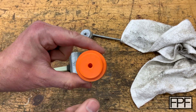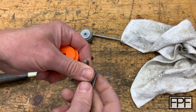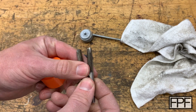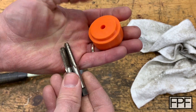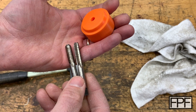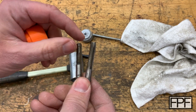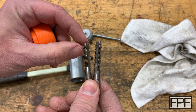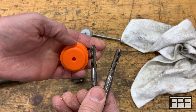I didn't make this hole super deep as I didn't want to get anywhere near the front face. A standard tap has a nice taper going in to get centered on the material, but won't cut threads all the way to the bottom. The bottoming tap — you can't really start threading a hole with it, but once you've got the majority already threaded, you can switch to it and get almost all the way to the bottom, within probably two and a half millimeters.